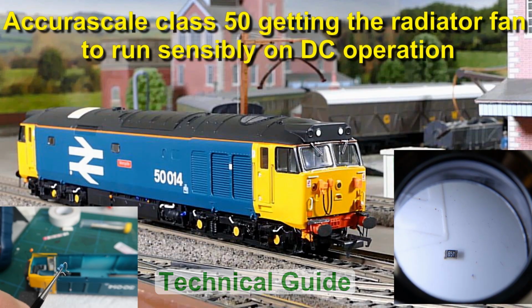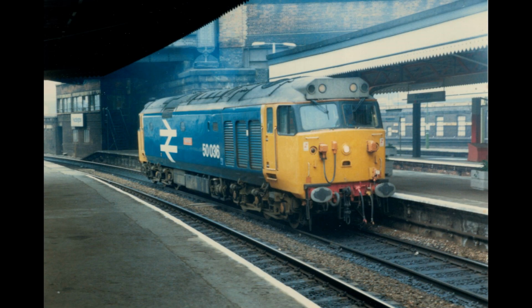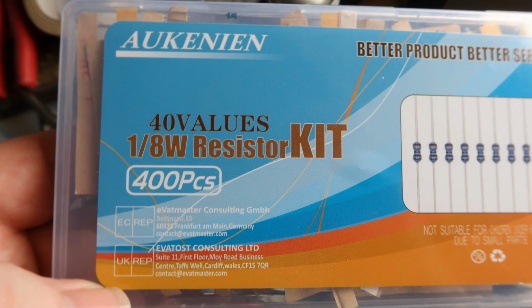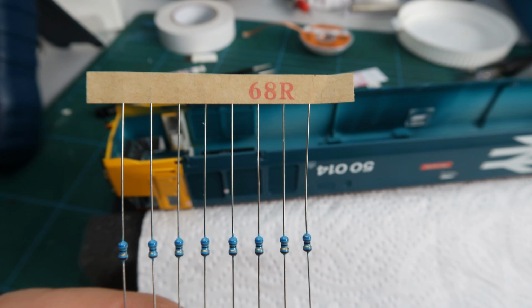Welcome to this technical guide video about the wonderful Accurascale Class 50. This guide is for those who have soldering skills and a fine soldering iron and access to de-soldering braid and some 1/8 watt 68 ohm resistors, or a replacement surface mount resistor of 68 ohms.